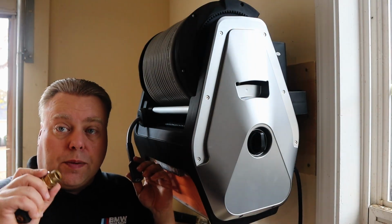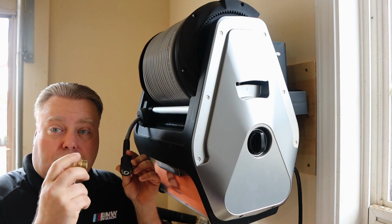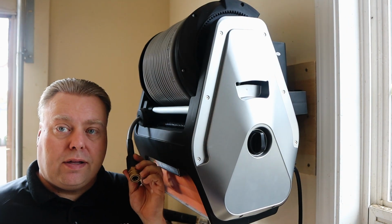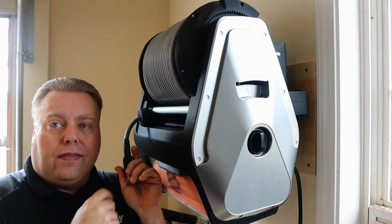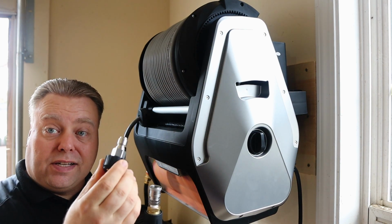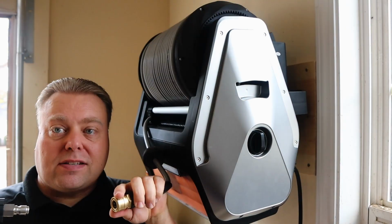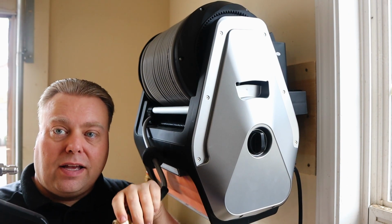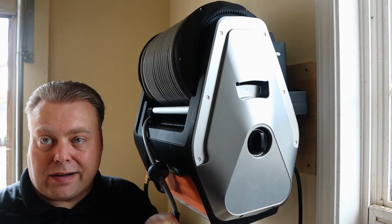Now this is another quick, cheap upgrade that I suggest, and that is to convert your M22 to a 3/8 quick disconnect. This is going to allow you to connect to most aftermarket guns and also just make the quick disconnect between your regular stock gun and the hose much easier. So on the other end of that is an M22 14mm to 3/8 plug that will screw right into the bottom of the gun. Now that's going to allow you to quickly connect and disconnect your gun from your hose, so that way you can mount it up here separate without having all that hose hanging around.